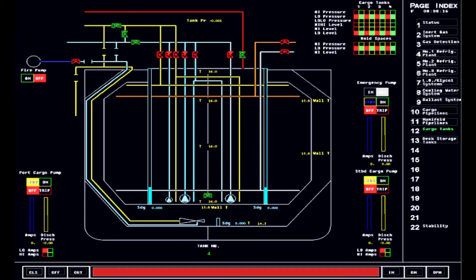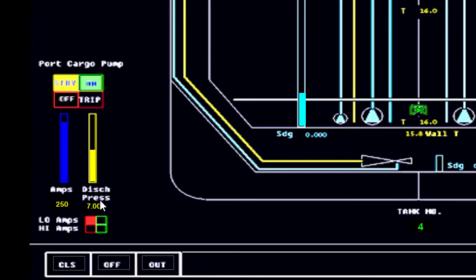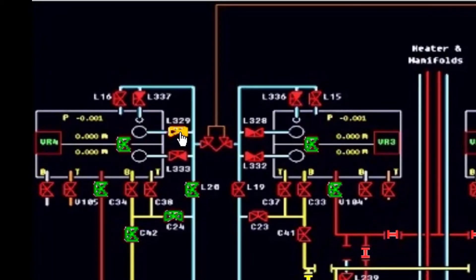We are basically ready to line up for spraying the tank. From cargo tank number four, we start and open the discharge valve a little bit — crack open. The valve can open so that liquid on both sides of the tank will be pumped out equally. So now we can start the pump. Take note that in operating the cargo pumps, you have to make sure that they are freely moving or rotating. I'll explain that later in another demonstration — if it got stuck due to some hydrate formation, then that has to be freed using an alcohol system. We are ready. We can start the pumps. The amperages are running and there's a discharge pressure of about 7.0 bar. We can just control that pressure utilizing the discharge valve. It goes through here and through the condensate line. The discharge valve for the cargo tank number four pumps is throttled.